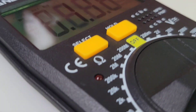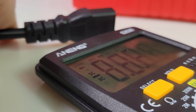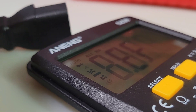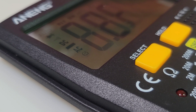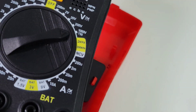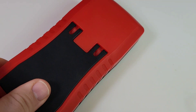NCV mode is next, and unfortunately it's not that great. Here's 120V on the wall — and yeah, really crappy NCV performance. It's too bad because the shape would have been so handy for non-contact voltage testing, but it's a fail. Oh hey — if you're traveling with the SZ08 and don't want to scratch the screen, just flip the body around as a cover. Total protection. Love it.